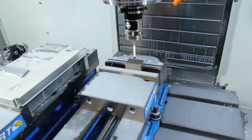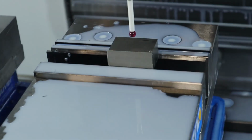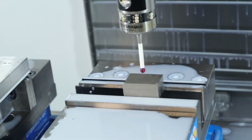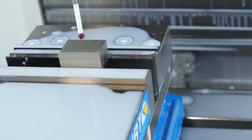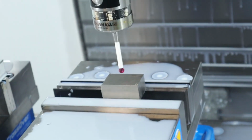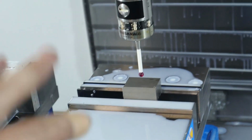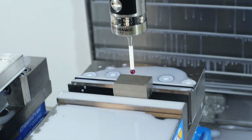Alright, so unfortunately I have a huge piece of stock that we have to sacrifice. It's 303, that's all I had on hand for stainless. So we're going to do the stock prep, so that means we're going to face it down to 125, like I said, and then we're going to put 2 holes in it, and those will bolt up in the plate up there, and go from there, and oh boy.